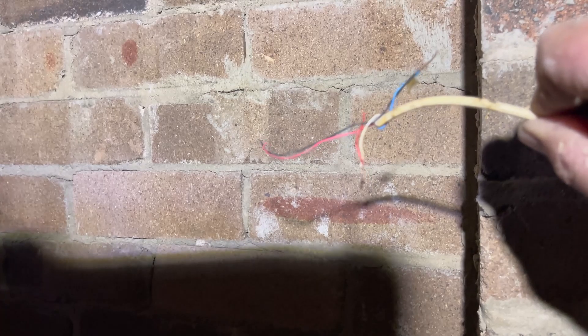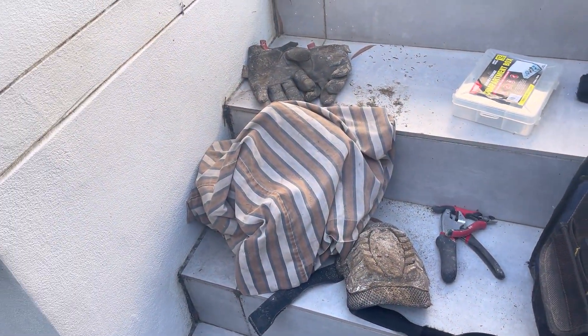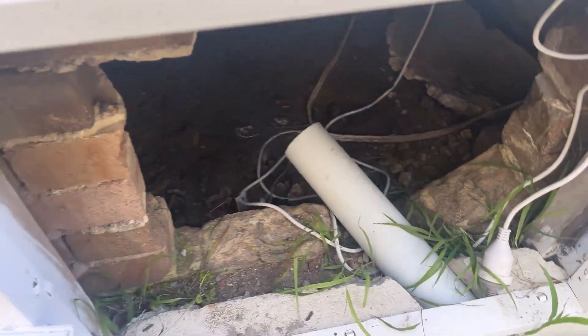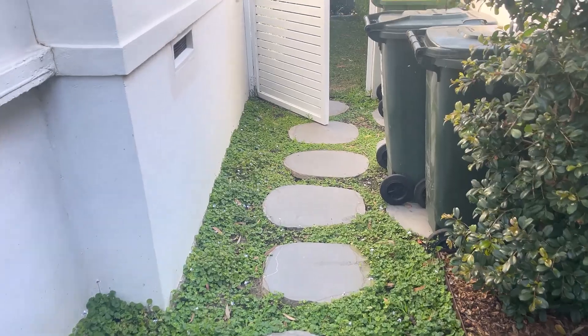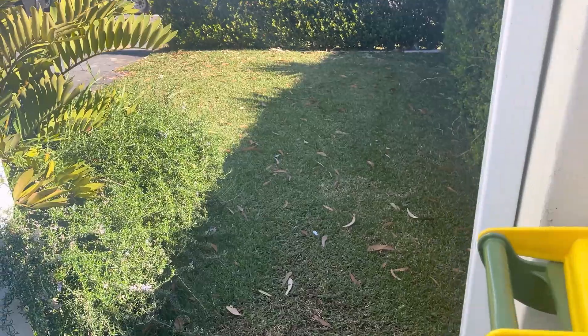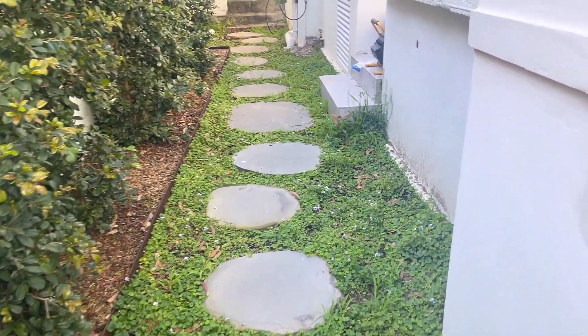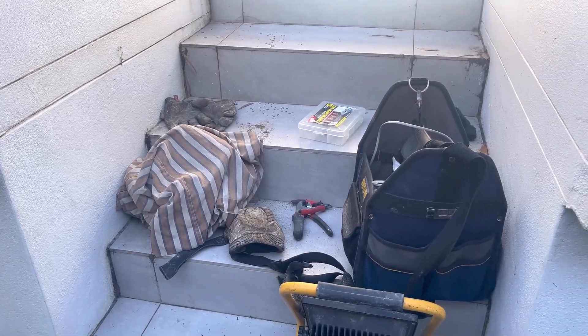I've taken off the tape, and you can see they just twisted them together without any Scotch Locks or anything — so don't do that. Okay, so that was the result. Just went back in, plugged his FTTC connection device back on, and now they've actually got internet. They're getting 52 down and 20 up — they're getting what they're paying for. So the problem was actually the bridge tap, but the leading cable is obviously going to be a subsequent issue. I'm going to do a report for them with photos of that old paper-insulated cable. He's had five NBN techs come out here. They just turn things off and on — that's all they do. Now you've actually got to get your hands dirty.